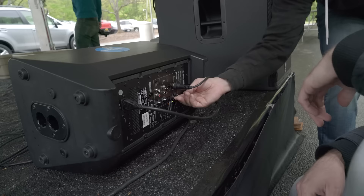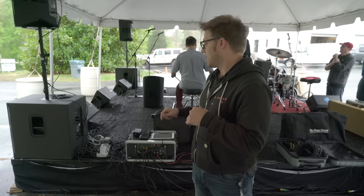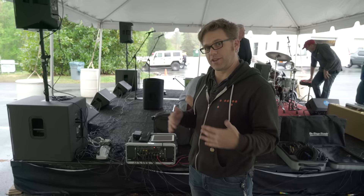All of our high and mid frequencies are coming out of the top, all of our sub and low frequencies coming out of the bottom. Out of the auxiliary outputs from our mixer are going down to the DXR10s — the Yamaha 10-inch monitor speakers, also powered. This eliminates the need for having an amp rack, so it's going to lighten your load if you're loading in and out.